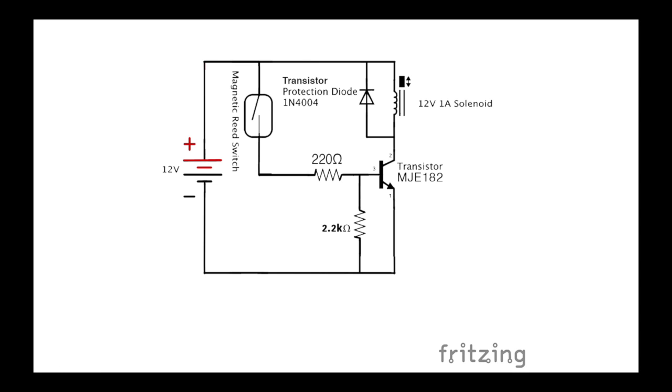So I wanted to be able to turn the thing on without consuming a lot of current. So this is the setup that does it. I'll explain all this. When we hit the switch, we basically complete this circuit here through this emitter base junction. These two resistors act as a voltage divider. So there's a voltage across this resistor that supplies this junction, and then this is a current limiting resistor. So this restricts the current that's allowed through here, which is really what is important. You need a certain voltage to turn it on, but you also want to make sure that you don't have a lot of current flowing through it. Just like with an LED, when you put current limiting resistors on there, same kind of thing.